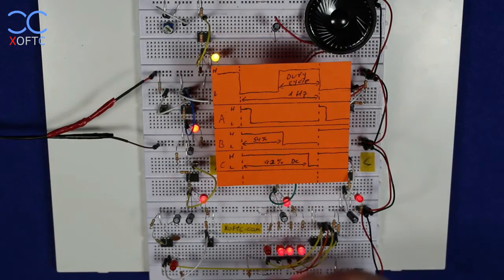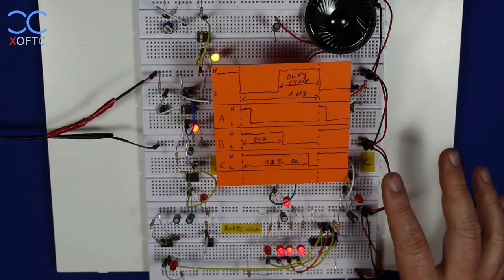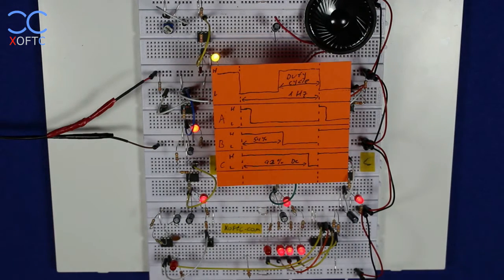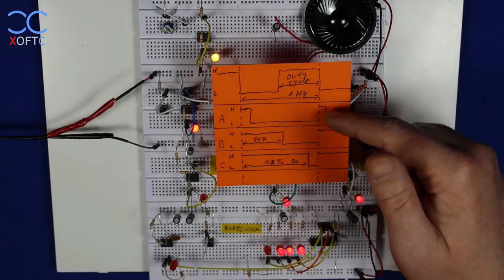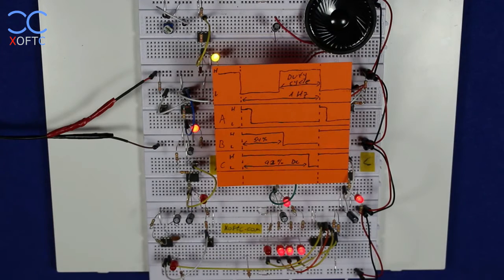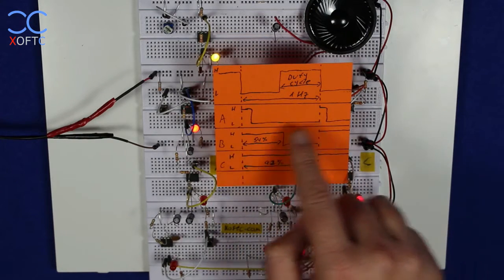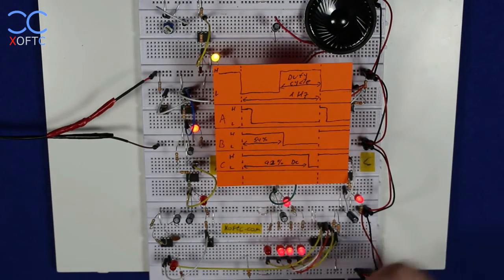Of on and off. If we look at example C, we see that the LED is most of the time on with just a fraction of a moment that it is off. And it has a duty cycle of 92% and 8% time that it will be off. And example A, we can see it right here, the way I've drawn it, is that the duty cycle in this one is 23%, if I remember correctly. And this is what we see. We see a short 23% of the cycle, of the time in the cycle it will be on, and the rest it will be off.